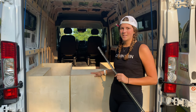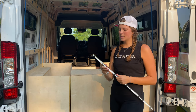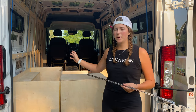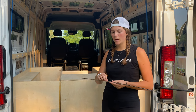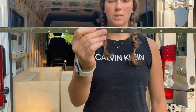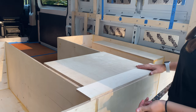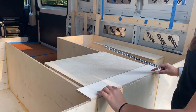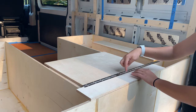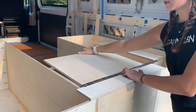When it comes to installing the tops on all four sections of my bed area I have opted for a piano hinge, also known as a continuous hinge. The reason I'm using this is because of their length — it's really crucial to have that support all the way down the full length of the bed because the tops are really big and heavy, so this is going to help it stay in place and not fail over time. So what this piano hinge does is it folds within itself. There are a few different ways you can install and mount them — you can have the hinge lay right on top and screw it in on both boards so it is visible, or you can take the route of making a hidden hinge where you install one flap to the inside of each board.